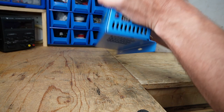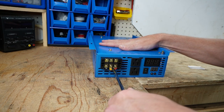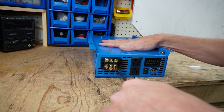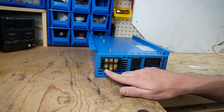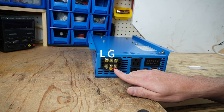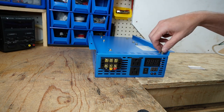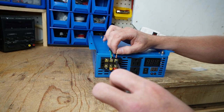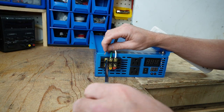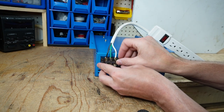You're going to want to take the inverter and flip it upside down. I'm going to check that these wires are all tight — and they could actually all use a little bit more of a tighten. The black wire is going to be your load or line wire, this one is your ground wire, and this is your neutral wire. We also have a ground wire connection here to chassis, so you can hook this up to a vehicle chassis. I'm going to start with my ground wire first, then my neutral wire, and last my line or live wire. Once these three wires are connected and secure, we are going to replace the protective cover.